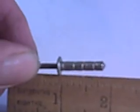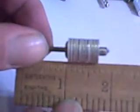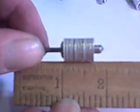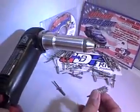As you can see here with a little ruler, this rivet is almost 7/8 of an inch long. We're going to use aluminum washers here to demonstrate material thickness. As you can see, they're well over a half an inch — they're a little bit over 5/8 of an inch thick. We're going to use our cordless battery power tool that has a special attachment at the end that sets rivets.